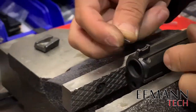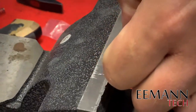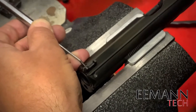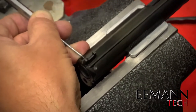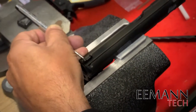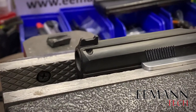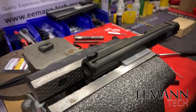Go through in one clean go — done. That's all we need to do. Clean out the hole, get our roll pin that comes in the kit with the front sight, get it started, and then send it home with your punch. Front sight installed. Having that pilot hole pre-drilled through the front sight from the factory allows us to line up the drill bit, and as you saw, the amount of material that came out of there — it was quite easy to do. Front sight is in nice and neat, no issues.